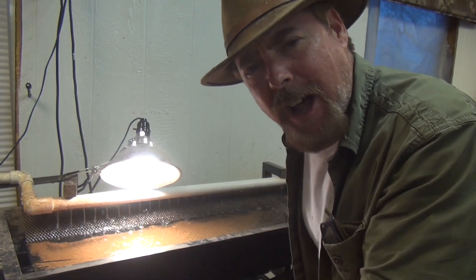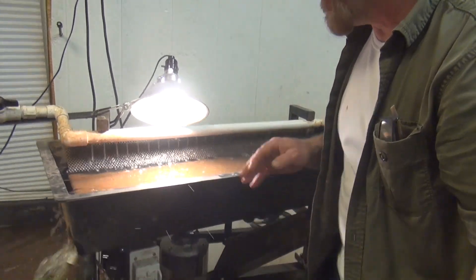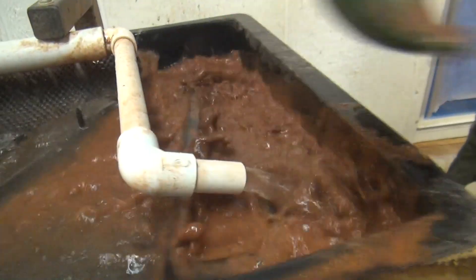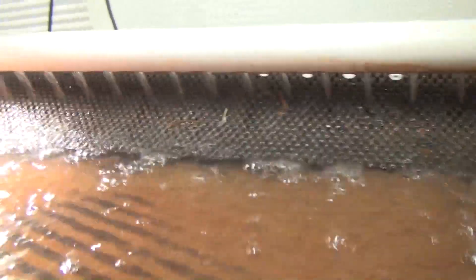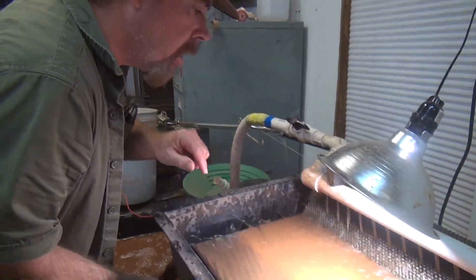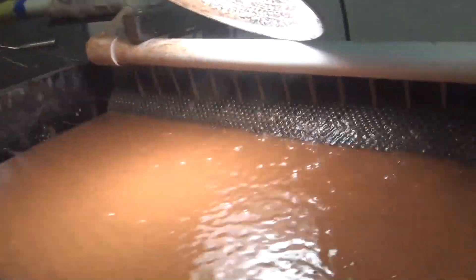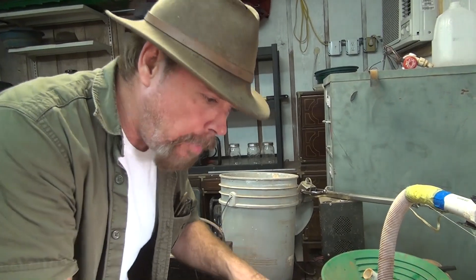Most of these units are built with a GFI, so you don't have to worry about getting electrocuted if water gets on the control box. Throw your switch and it'll start shaking. I highly recommend feeding the material in wet right up at the top. What you're looking for is the line of heavies — that's why a light is so important. I've got my gold line right in here, but the water's so dirty it's hard to see, so I'm going to shut that off. It's very important to have a large reserve of water, because a small reserve will get dirty fast and you won't be able to see the gold line when making adjustments.